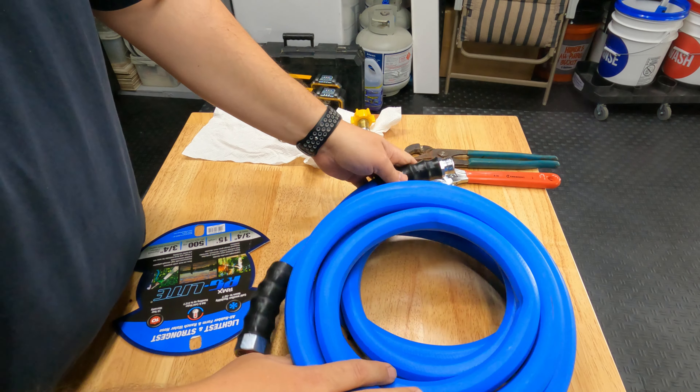This piece is going to be used because we have hose bib to hose bib, so I need to transfer from male to female on the other end. I need to connect this end to this quick connect. These are my favorite quick connects — MTM quick connects, stainless steel, they're awesome. I'm going to push this rubber gasket down, make sure it's seated in place, screw that down, and just give it a little twist with the channel locks. That's all you need.